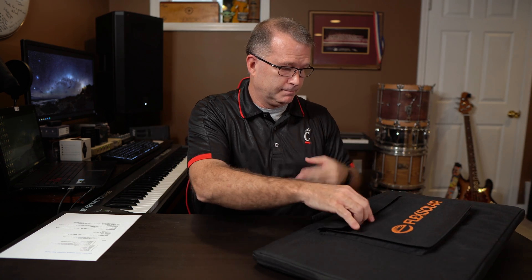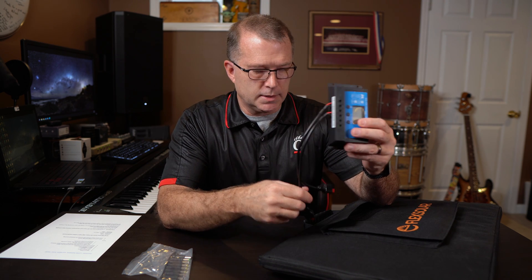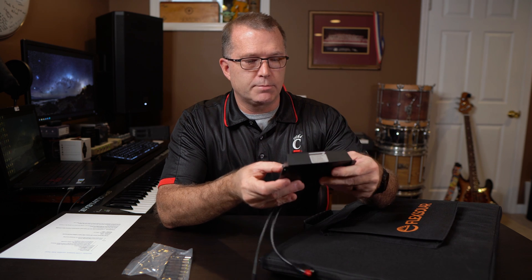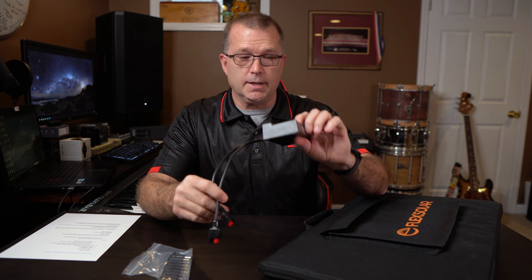Let's find out what this panel comes with. Right out of the gate, it comes with a whole variety of connector types. It also includes a 20-amp PWM charge controller — not an MPPT — so it's designed for smaller projects. It comes pre-wired with an Anderson connector that goes to the solar panel and another Anderson connector that goes to an adapter cable.